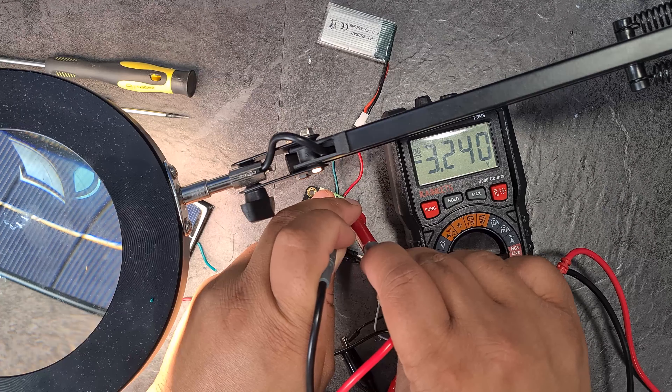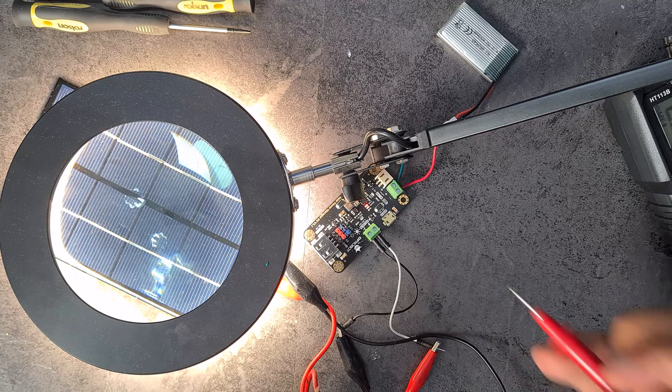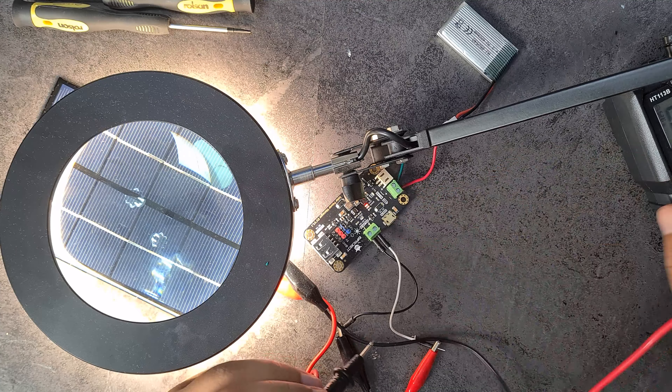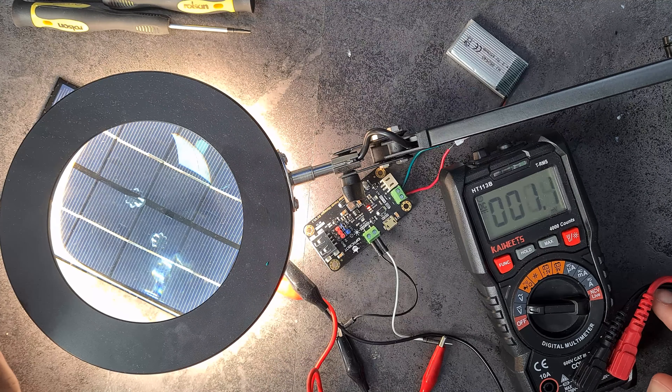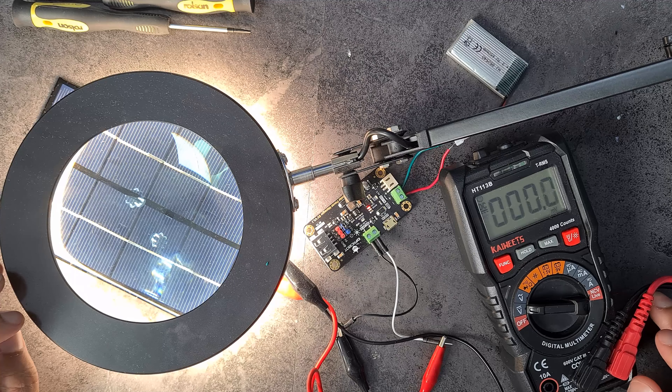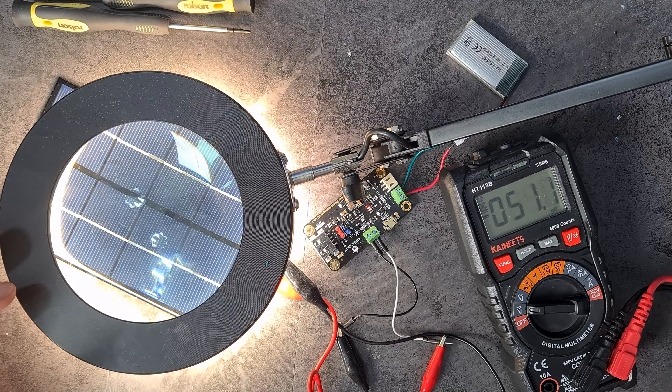The battery is now at 3.2 volts, charged back up nicely. Let's see if we can get it up to 3.7V - fully charged would be 4.2V. After a few hours of checking, I believe it has some sort of slow trickle charge feature. The input is still 4.4 volts and the output to the battery is 3.4 volts. It's going up very slowly - probably won't reach 3.7V for nine or twelve hours.